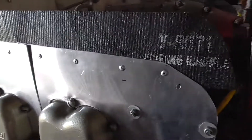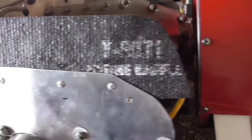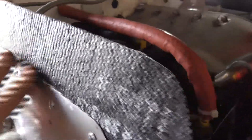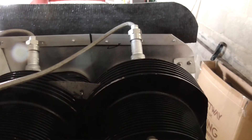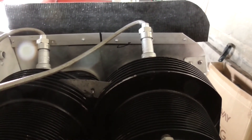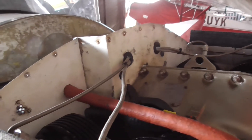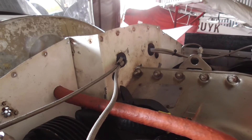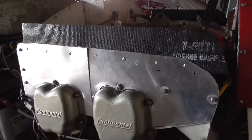The baffles are on now. We have tested them — well, we tested this side, we get to test the other side. But they do fit really well. What I've done is I've riveted that side. I've put an aluminium strip instead of the washers, and likewise I've put a split in it so it doesn't crack over the entire length. I've still got one last job, which is going to be a fairly complicated one, because I've actually got to now put the baffles on the back. But we're getting there, and I think it's looking fairly neat, even though I say it myself.